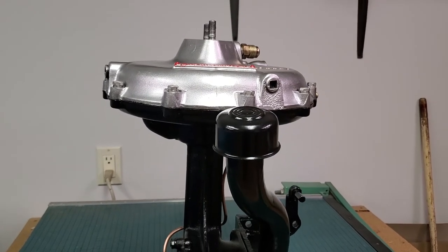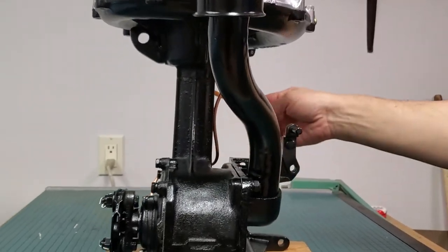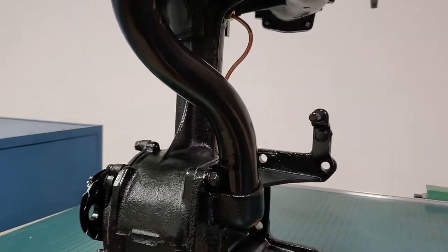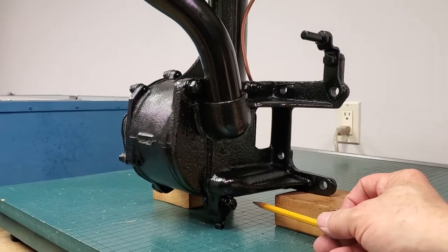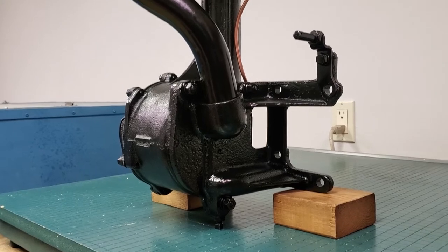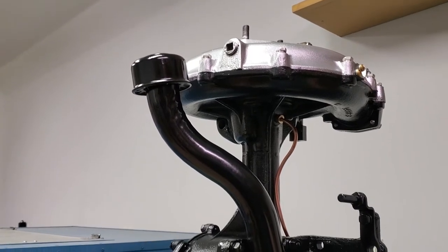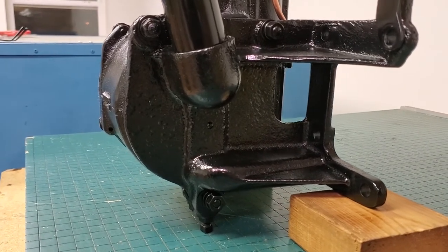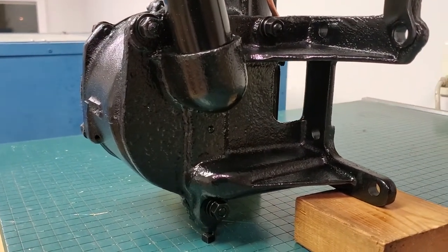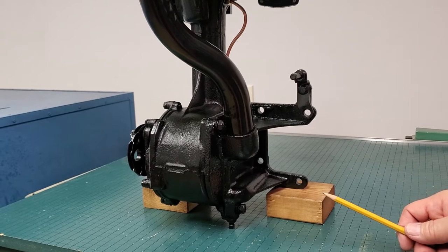You must remove the rotor first before you even begin disassembly. There's also a series of other parts on that vertical shaft that have to be taken out. People think they can hammer on the bottom because they're looking at the bottom of a shaft that was turned between centers at the Graham factory. The shaft is extremely complicated — they went from machine to machine with each performing a certain operation, and by turning between centers they kept everything concentric even through setup changes.